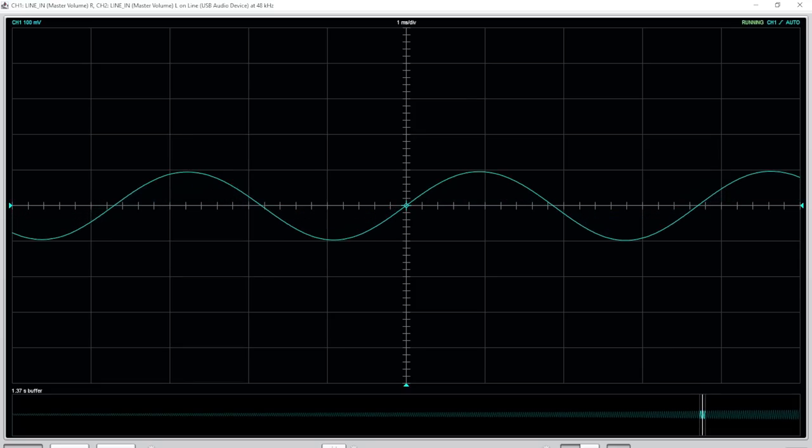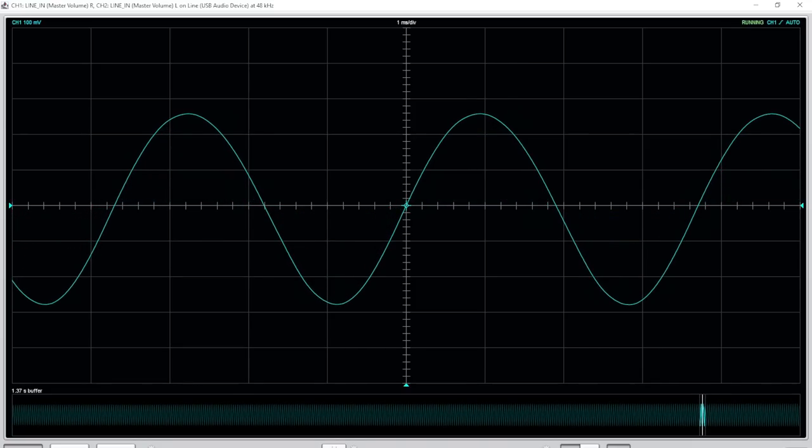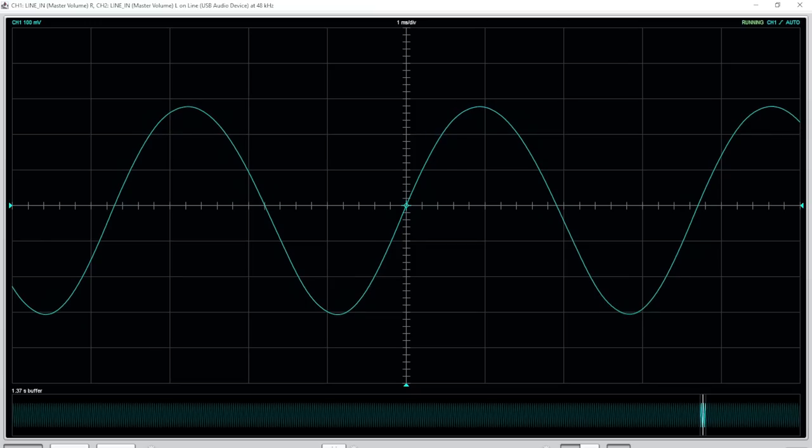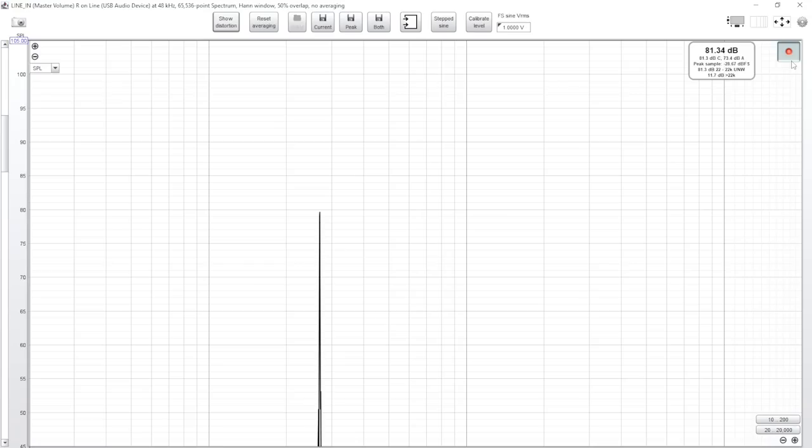The 270, which is another loaded frequency, looks beautiful again. It's very similar to the 150, all the way up to 15 watts. Yeah, looks fine. No visible deformation, and it's very equal top and bottom of the sine as well. A super strong fundamental with the second harmonic only creeping in as we get really loud, and the third is barely anywhere to be seen, with the fourth just being like, yo.